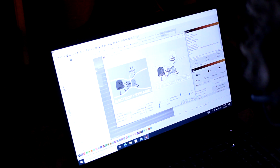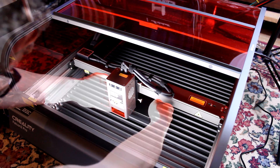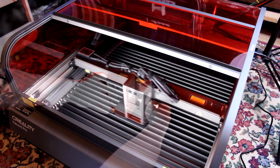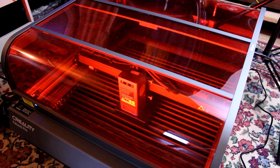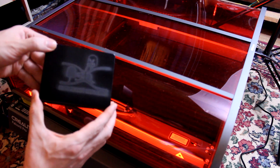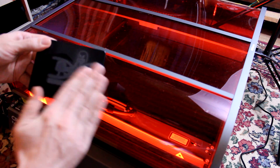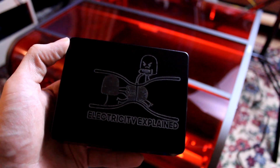My next thought was whether it could do multi-tone graphics, so I copy and pasted a picture from a meme into LightBurn. LightBurn has an amazing photo adjustment and enhancement program inside it. I used the frame function to let the laser head show me exactly where the graphic would be, then moved the box under the desired target. It took several tries but I got it exactly on the right side, leaving a gap on the left side for knobs. Once I scrubbed it, it looked amazing, and you can then go back into LightBurn to add drilling points for volume, tone, and gain controls.